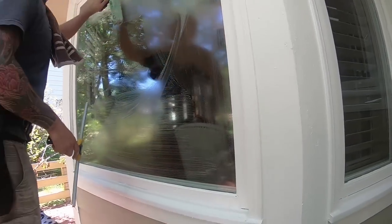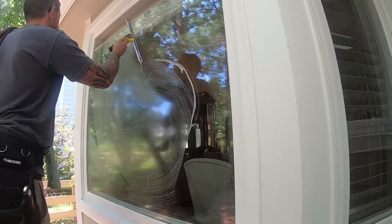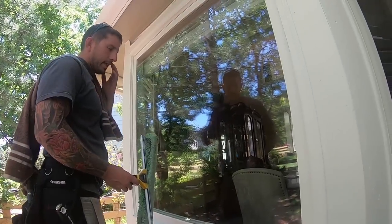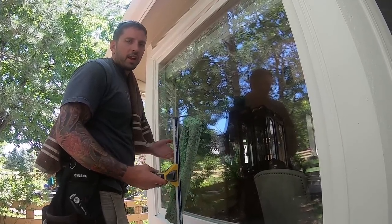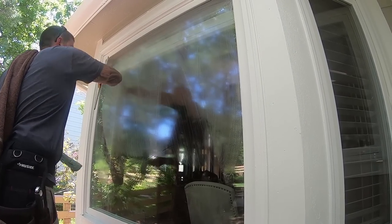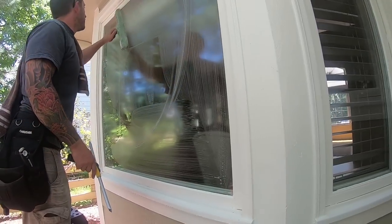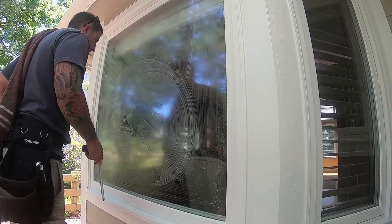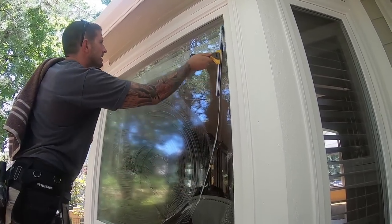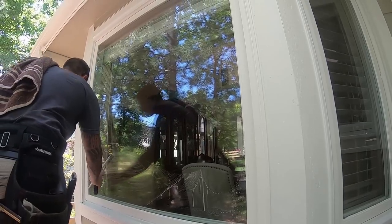When you fan, let the weight of the squeegee just fall, and right as it reaches the point where your arms are a little uncomfortable, curl it back in and bring it the other way. Another problem is guys thinking that on top of a ladder they need to start in a certain area. Right-handed guys think they need to cut in going to the left, and left-handed guys think they need to cut in on the right. Wrong — you can cut in from anywhere when fanning. I actually really like starting in the upper part of the glass, because then you just come back down and you're not having to grab that block of water at the entrance.